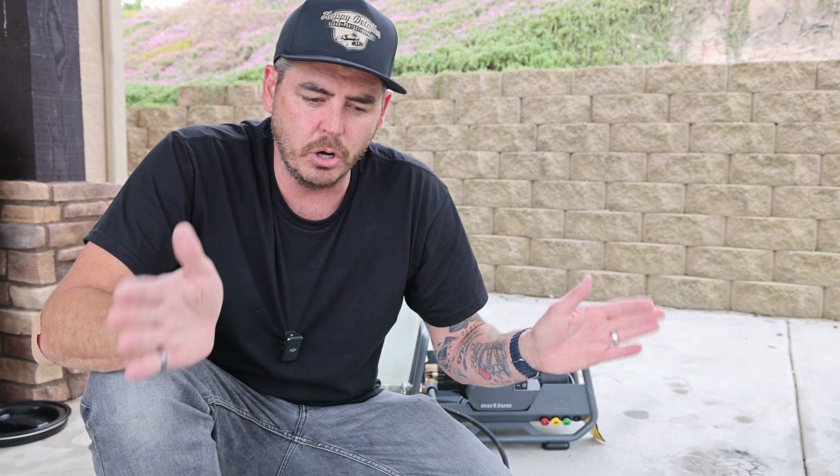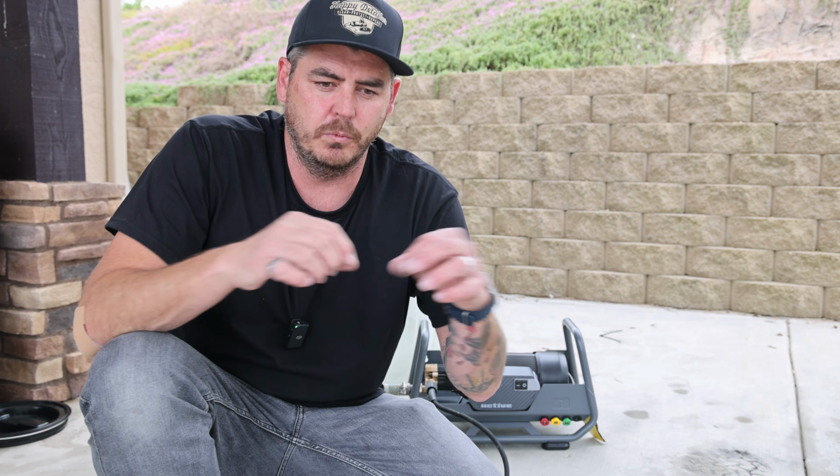However, they have had issues with their 2.0 and an UBERFLEX. I'm coming to find out more and more. My unit's okay. Sometimes it runs a little bit longer than it should, but it's not surging on me on my 2.0, and I am using an UBERFLEX hose. I've used an UBERFLEX hose with everything else without issue. So I wanted to see, is it really the UBERFLEX, or is it a component within the pressure washer on the 2.0 that may not be able to handle it? I don't know. I've seen a side-by-side comparison, factory hose to an UBERFLEX hose, and it seems like the UBERFLEX hose is the culprit for the 2.0 surging. Because that hose is not steel reinforced, they say that it expands. Now, it doesn't really expand. It does tighten, obviously, when water goes through, it may expand like 1% or something. But once it's filled, it's not contracting and expanding each time.